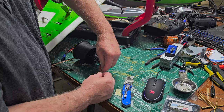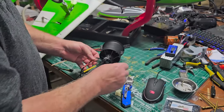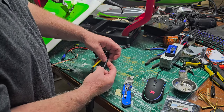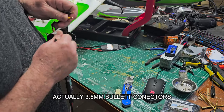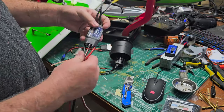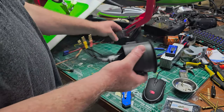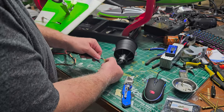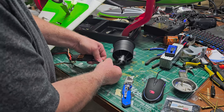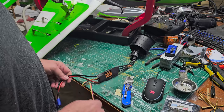Be careful taking this tape off. If you remove a little bit of insulation and see a little bit of metal, don't let that bother you. With the tape off, you can see where the separation is — grab both hands, slide your banana plugs and move them out. Now you have your old ESC free. You can save it and put it in another model — it's a brand new ESC, nothing wrong with it, but I want reverse thrust.